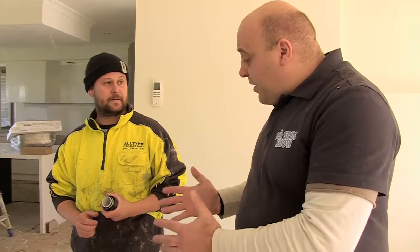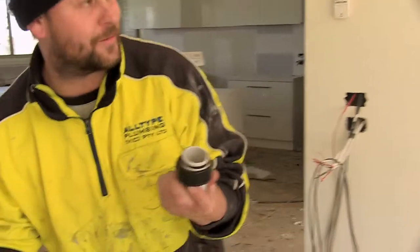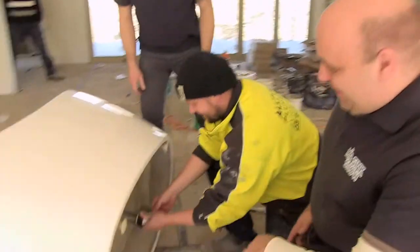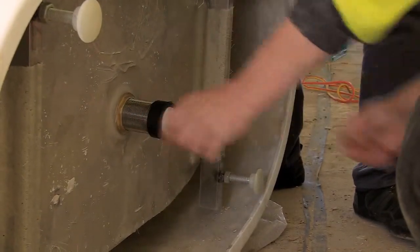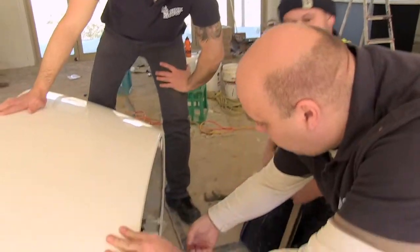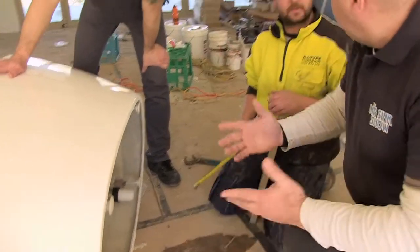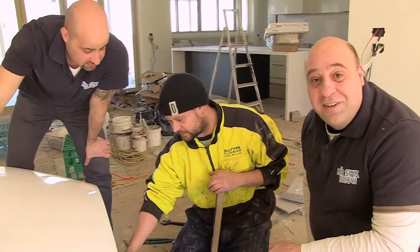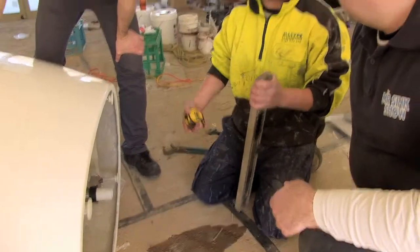Aaron, what's the last step now? Once we've done all that, we get our cap lining, nut and tail — put it in and tighten it up. That pipe sticking up in the floor is where we glue it into. The pipe sticking out of the floor goes over the fitting. Always use a licensed plumber. It's always better to use a fitting that goes in rather than over because of the flow of water — you want to keep the fitting going with the flow of water.